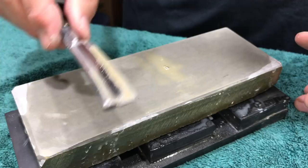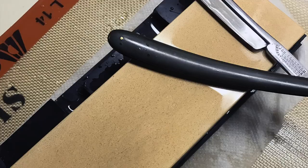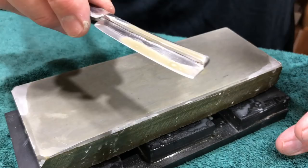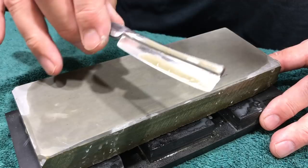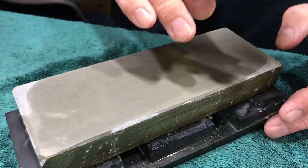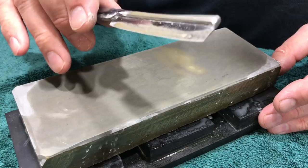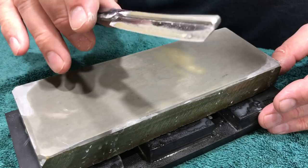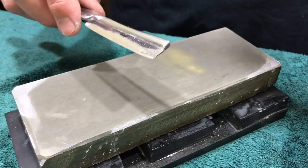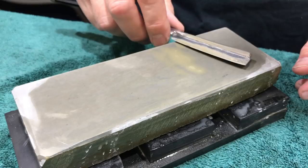I'm going to drop a picture in here. That's my 8K — that's this razor on my Fuji 8K. I did an extended number of laps — I'm going to guess about 45 laps on that stone. I usually never go more than 20 on an 8K because I don't have to, but these Swedes, these framebacks from Engstrom, are very, very hard so I need a lot more time on the stone. If 20 is normal, then 40 is normal for this. 20 would be normal for a Sheffield. I don't count though — I go by feel. There should be no swarf on my 8Ks ever. If I have swarf on my 8K, I either didn't finish my 5K or I used too much pressure.